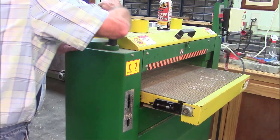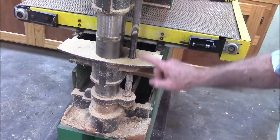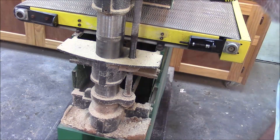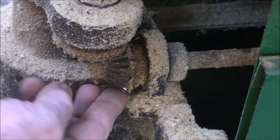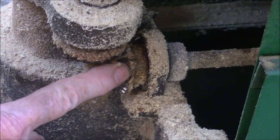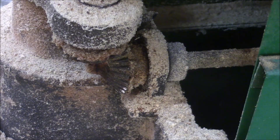She's all locked up — having trouble adjusting the height. Pretty dirty, it's filled with sawdust, and the worm gear here is dry and needs to be lubricated. I'll clean this side up and then turn around and do the other side. I'm glad I didn't force it, because look at this gear here — completely dry. When you turn this worm gear it transmits the energy over to the other side. This gear is clogged with sawdust and it's real dirty, so I really need to take a round turn on that.